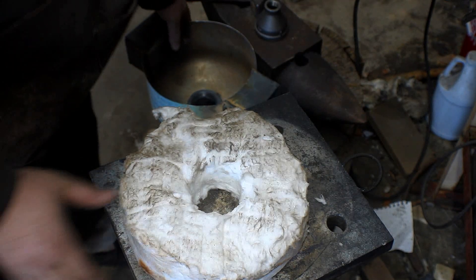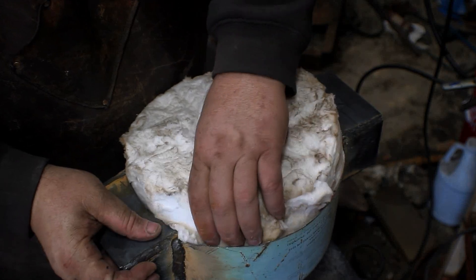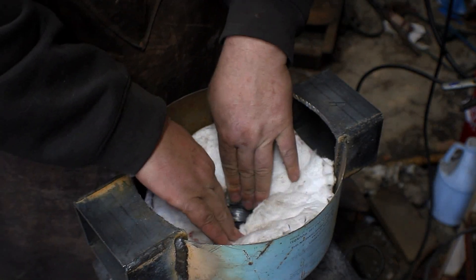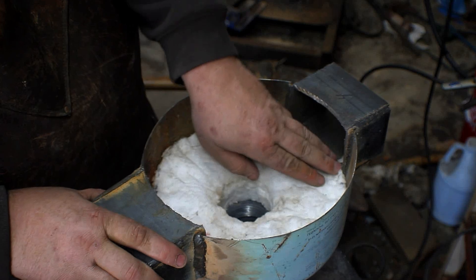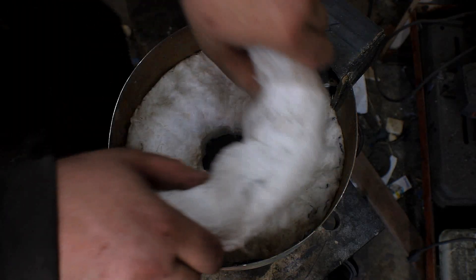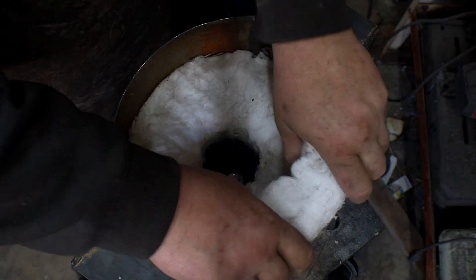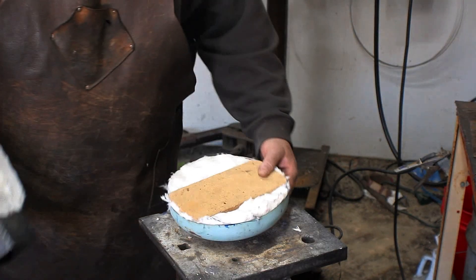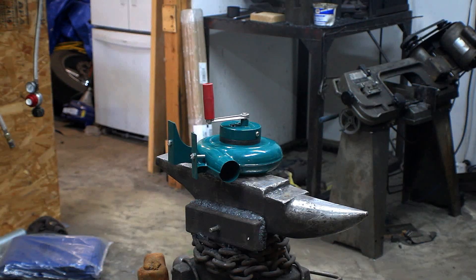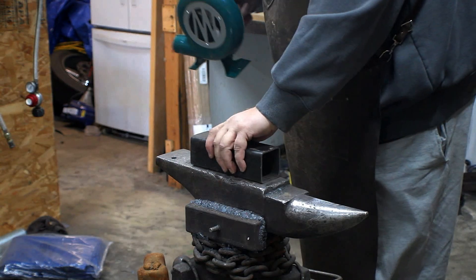We'll be coating the entire inside of this forge with refractory — make a nice slurry and it'll help keep some of that ceramic wool from flying around and also help with refracting more heat into your piece. Now this is a travel forge, so it will break down over time as you move it around and pack it out to events. Just periodically — maybe once or twice a year — go in there and reseal it with a new coat; you don't have to do a thick coat, just redo it as needed. We got this blower off Amazon for about $39 and it works pretty good.